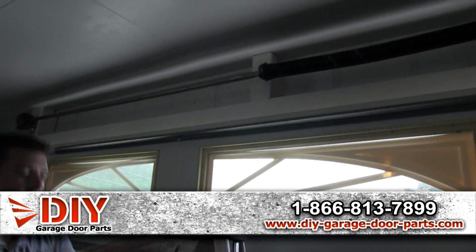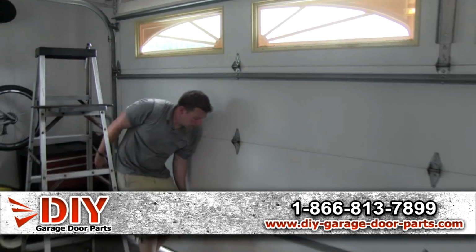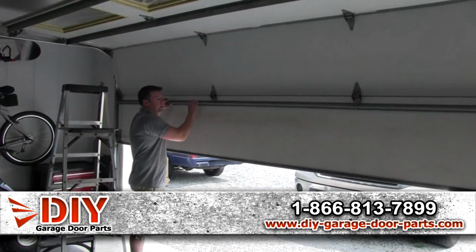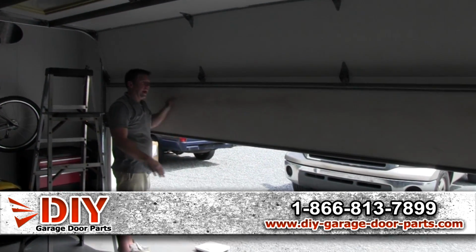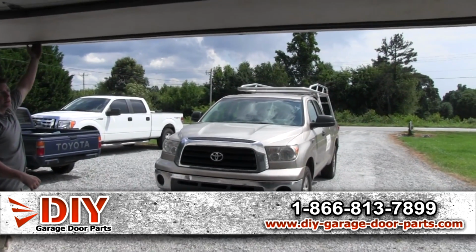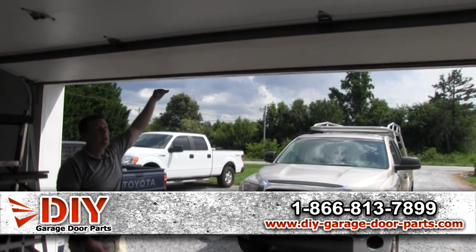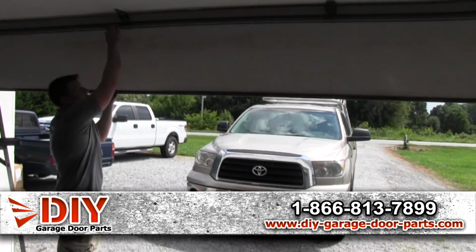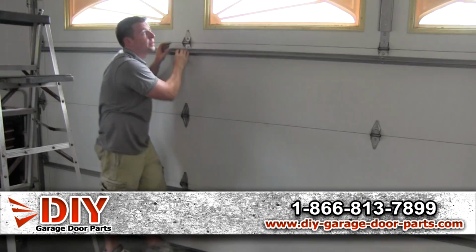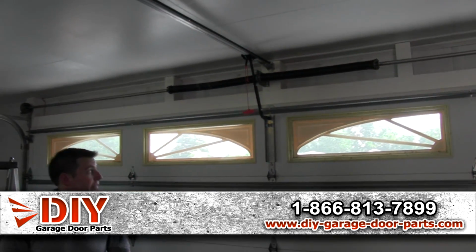In your door, you would want to check your balance of your door. You should be able to lift it pretty easy. It should set halfway on its own. Should be easy to raise. Should set up at pretty much level or a little lower than level of the door opening. You can go ahead and re-engage your opener and then try it out.